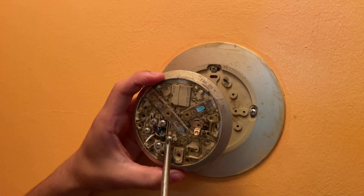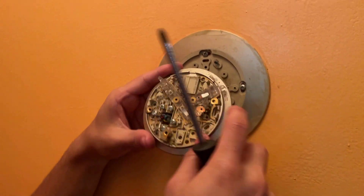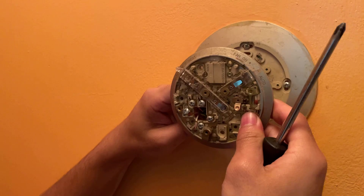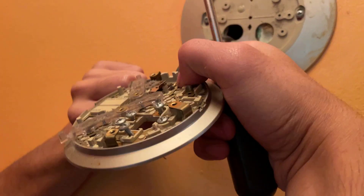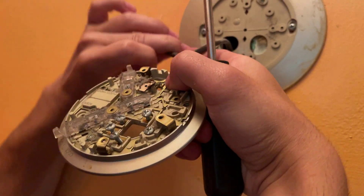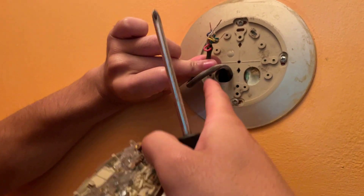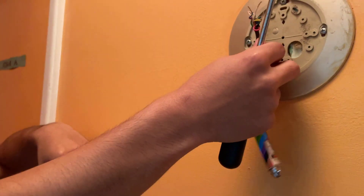I'm going to take the screws fully out. All right, so all of the wires are taken out of their posts. We're going to take the plate out and pull this wire out further so it doesn't get lost back inside. They recommend that you take a pencil and wrap the wire around it, just as another safety measure to prevent it from going back into the wall. We have this little token here taped to prevent it from going back in.